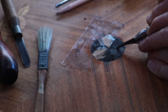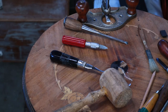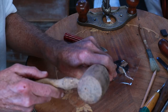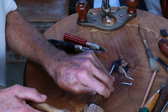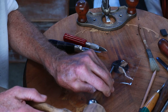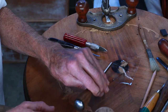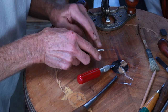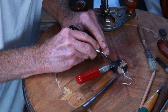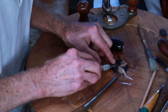I'm going to make sure I go deep enough — going too deep doesn't hurt anything, because it's when you lift out the center that's important. I'm going to take a very sharp chisel and very gently lift some of that out toward what we call the relief cut, which is the tracing. If you're doing wood carving, you chisel toward your relief cut, otherwise you'll get chip-out. So the relief cut is the most important cut, and I'll work this very carefully at the corners until it pops out nice and easily.